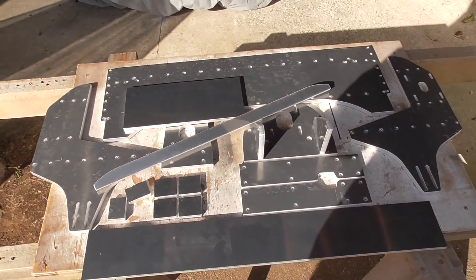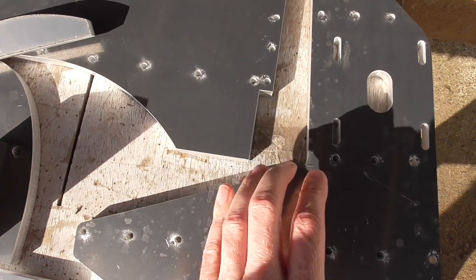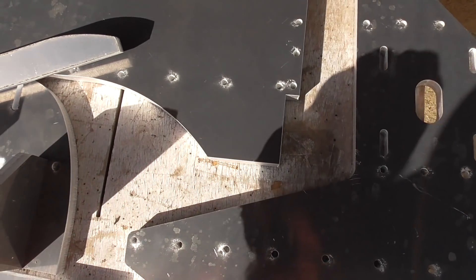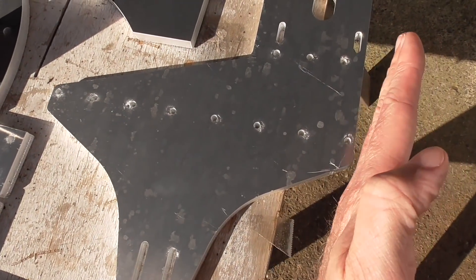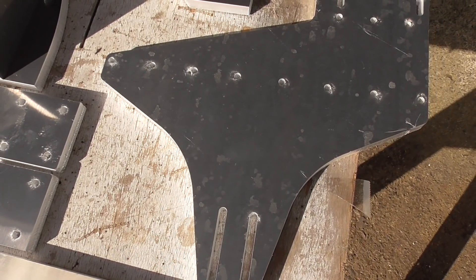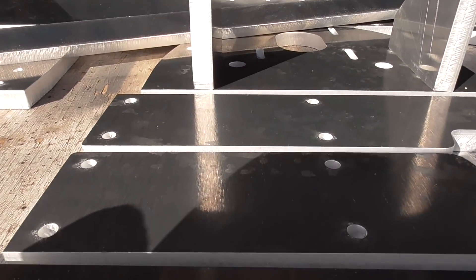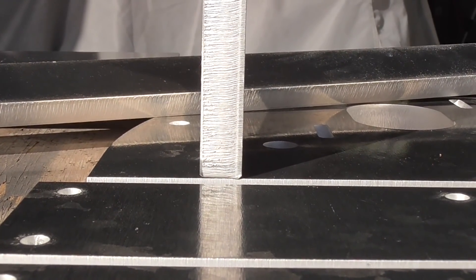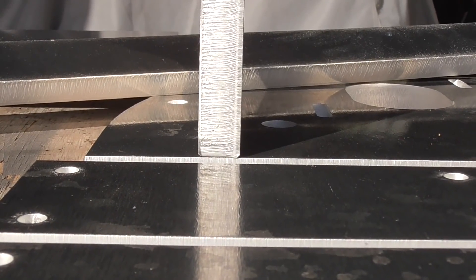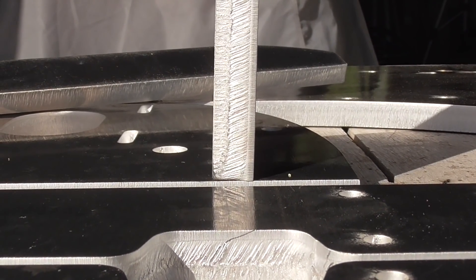This is a rib that reinforces, so it has to use these bolt holes all along there - it has to be a straight line. One other slight annoyance I'm going to have to deal with is that I left an extra millimeter and a half on this bit here that I'm going to have to sand off. The reason I did that is because I was worried the walls of the cut would be a little bit sloped like on the water jet, but it's not as much - not even close. A tiny bit of sanding will fix it to stand at 90 degrees.